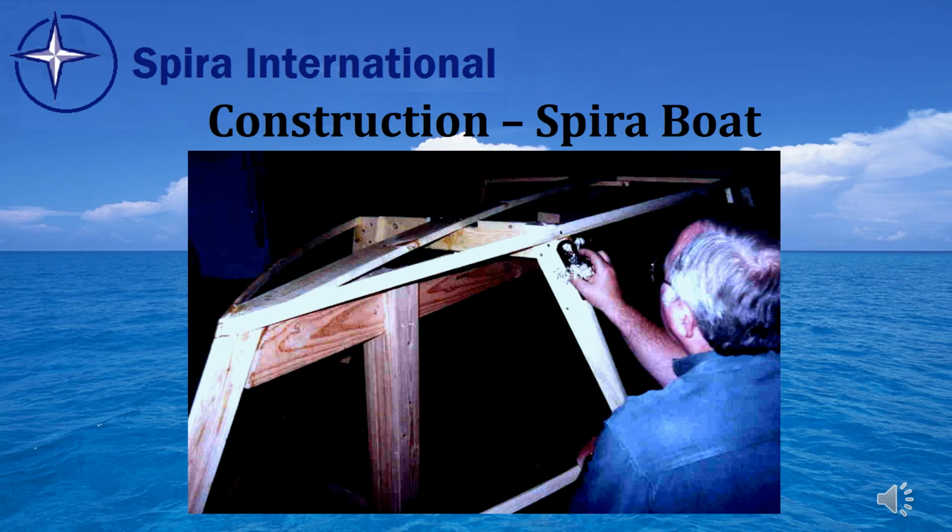After the glue holding these parts together cures, you can fair the boat. And by that I mean tapering the outside edges of the elements so that they'll meet the plywood covering more easily. In this example, I'm fairing the frames of the very first Ozark Fisherman hull using a block plane. Very simple to do.